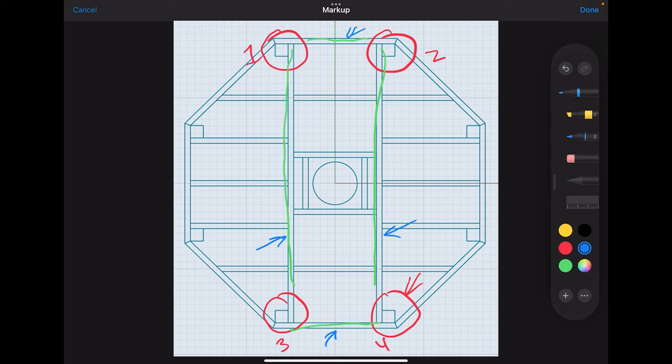Now, the nice thing is all the rest of the 2x6s are with respect to this original 4 posts and 4 2x6 layout. So it was very easy to then mock up the rest of this system and add the other elements to it because we had a square, level, plumb, really everything good starting point that we were then able to take off from there. So I think it was useful mentioning this again. We tried a lot of different variations. It took about a day actually to do this layout because I kind of didn't know what I was doing.